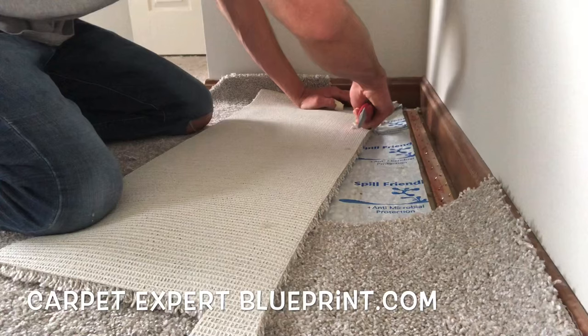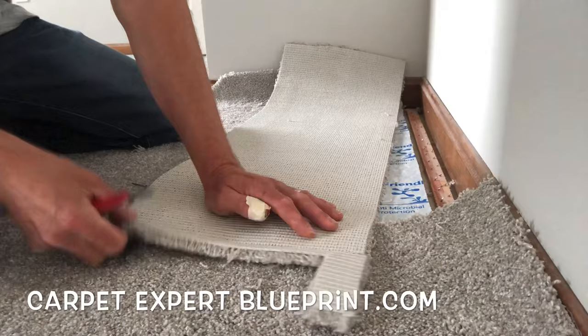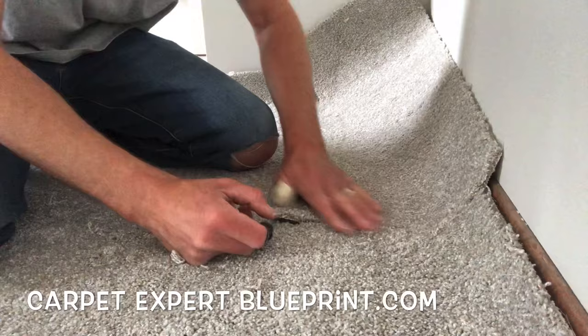Having a little bit of experience in the industry, I'm able to just do some freestyle cuts and put some clean, fresh edges on this carpet. If you don't have that, don't worry — you're just going to use a straight edge to cut the backing, get a nice clean edge on it, and then line it up. Our running seam is straight, so we're good to go there.